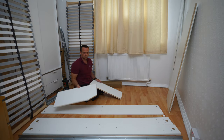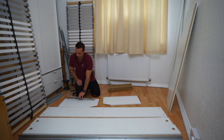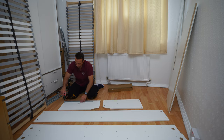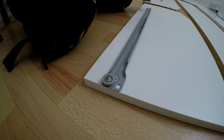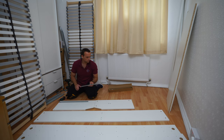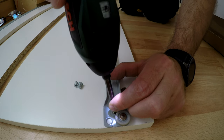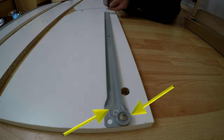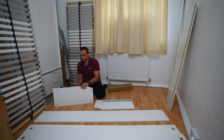Let's start with the two small panels. We're going to attach the rails first — three small screws to hold each rail. Watch the wheel: it should be positioned at the front on this side, and the cut on the panel is on the other side. Do exactly the same on the other side, mirroring what we did on the first panel. Secure the rail with three screws. The wheel is at the front and the opening on the rail is on the top.